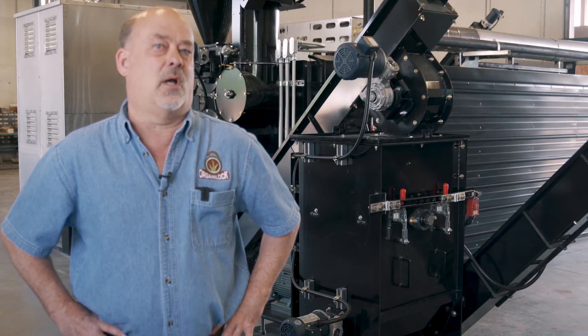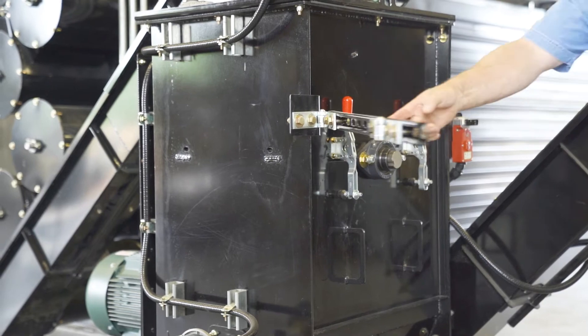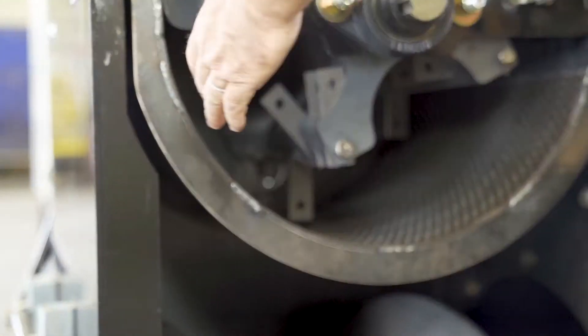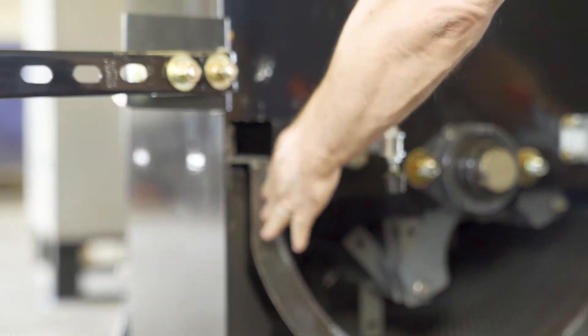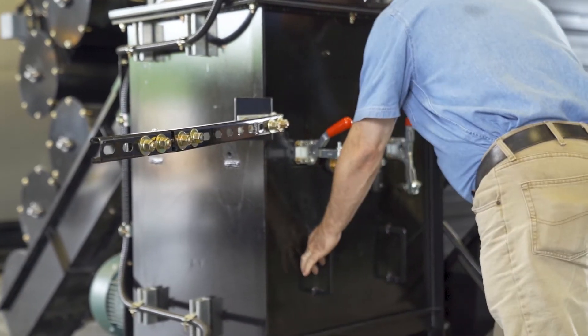At the end of the process, you auger the material out either into your pile as you're going to process it, or into our optional hammer mill to pre-size your final product to your needs. Behind me is the optional hammer mill system. It's a 20-horse system. The screen sizes range from 3/16ths to 2 inch. Everything's built and designed in-house. There is an airlock on top to guarantee the air direction of the entire system. On the door, there is a safety bar that guarantees the operator can't get into the system until the knives have actually finished spinning.